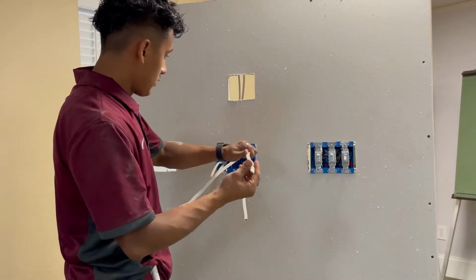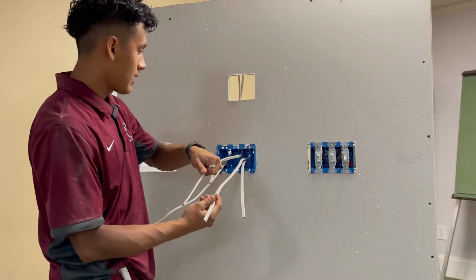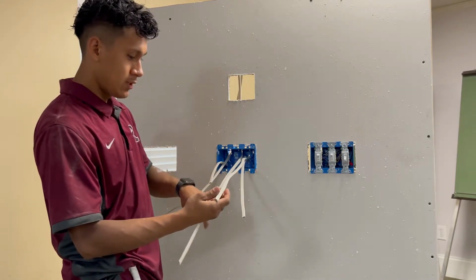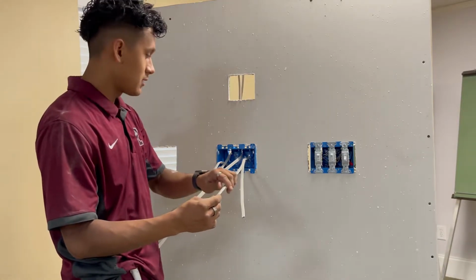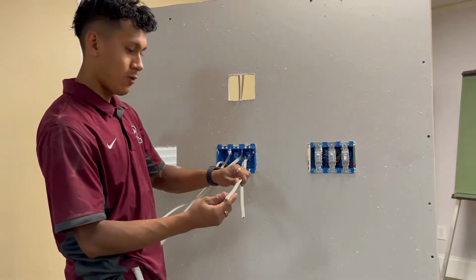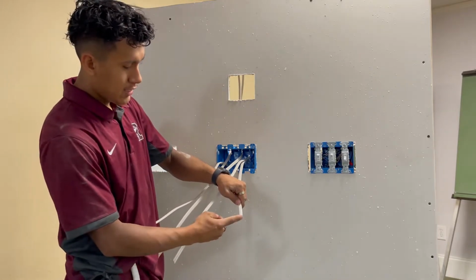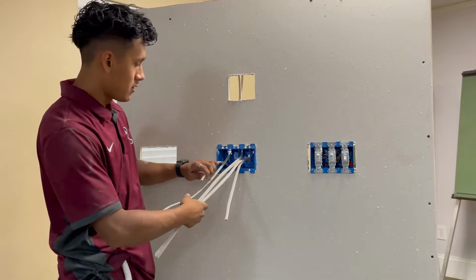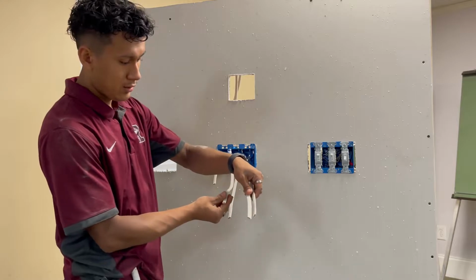First, the 45s, which are the lights and anything that would go on a switch, like when we do exterior GFIs, we usually put those on, if they want them by the porch light, we put them on a switch. So in order for us to know which one is going to turn on the light or a GFI, it's cut at an angle. Anything that is cut straight is a hot wire or a jumper. For example, like this one is also a jumper. So all the wires that are going to be at the top on the switch would be cut at an angle.